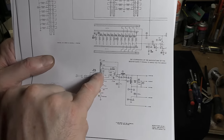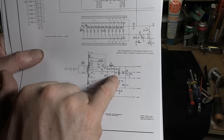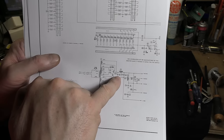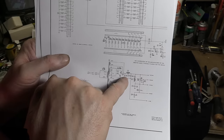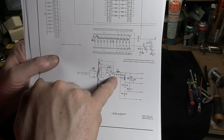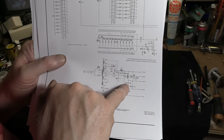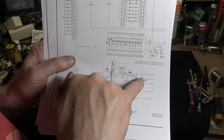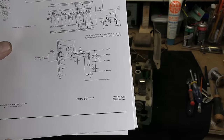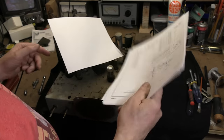It's in parallel with the focus control, so that will have some continuity going through there. But we need something here too — probably a 50 or 100 ohm resistor, something like that will do the job. This is what I was getting at earlier about the secondary center tap: it's not going to ground — it goes through a 15-ohm resistor to ground, and that develops a negative 4-volt bias voltage. It also means that these two filter caps forming the PI filter with that choke don't go to ground; they go to that 15-ohm resistor. Right off the 5U4 cathode, 30 microfarad — that gets hit when you turn the set on and it's not drawing full power. That's where you want your 500-volt cap for sure. These other caps downstream — I think 450 will be sufficient because there's resistance in the focus coil that's going to drop the voltage. So even though they specced 500-volt caps for a bunch of these, I think the only ones that are really critical are these two right here.